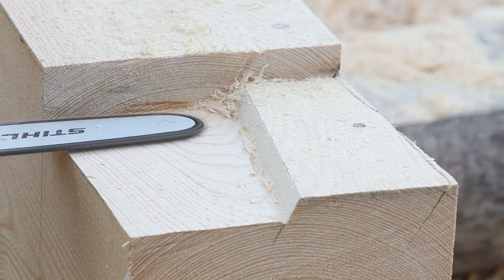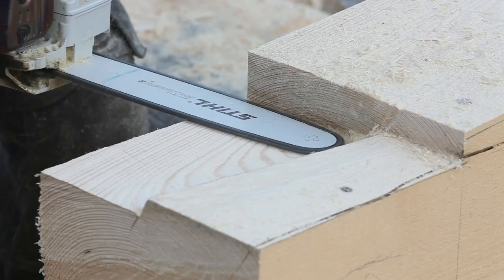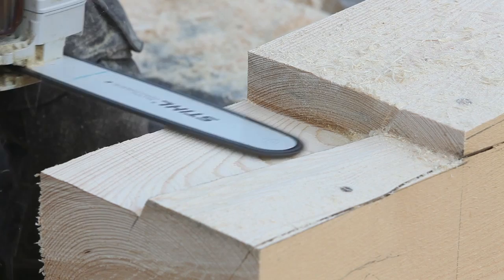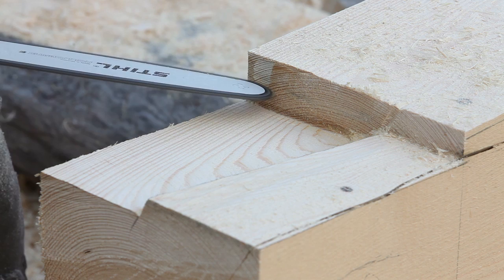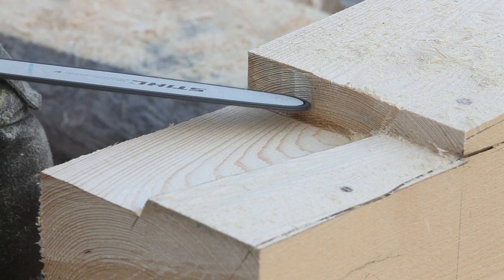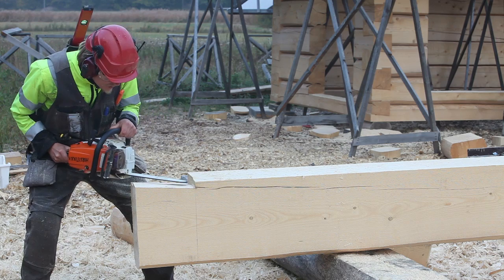The horizontal joints of the notch have to be concave to allow crushing in sliding. Also, the vertical joints need to be concave so that their edges can bite into the crossing wood. In this notch type, almost all the faces need to be brushed concave with the tip of the chainsaw's bar. Only the horizontal face of the upper notch is left flat.